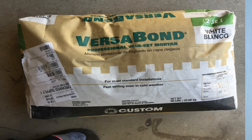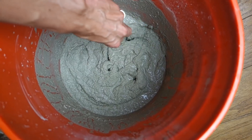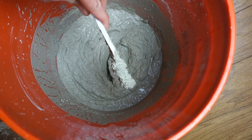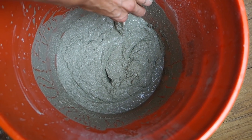The first item you're going to want is white mortar — make sure you buy white — $15, which I thought was still a good deal. You're going to want a bucket to mix the mortar in with water. The consistency you are looking for is a brown honey to a thick pancake batter. You want it to stick to the spoon a little bit but still fall off at the same time.